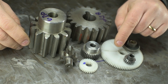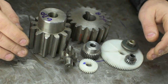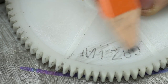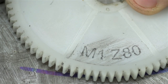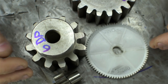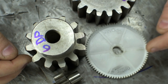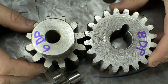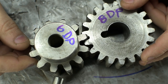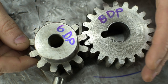My mini-lathe uses metric Module 1 gears — it's molded right into the gear: M1, 80 teeth. Z is the tooth count. Just like with threads, gears need to be all the same pitch if they're going to mesh. You can't mesh a Module 1 gear with a Module 2 gear, just like you can't put a coarse thread nut onto a fine thread bolt.